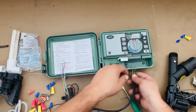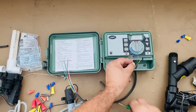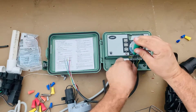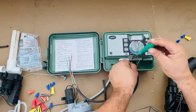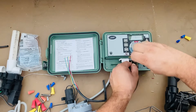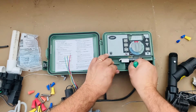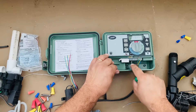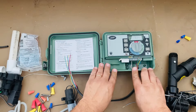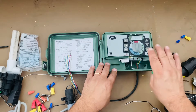When you start wiring the clock itself, you obviously feed the wire into the clock where it needs to go, and you want to wire the common wire up first. Make sure it is tightened down very well so there's no way that wire is going to be loose or come out, because if the common wire fails it runs the entire system — whether you have one zone or a hundred zones, the whole system is going to go down.